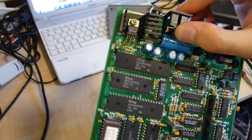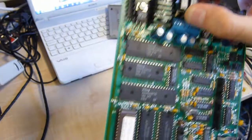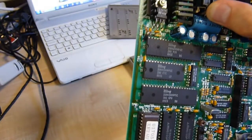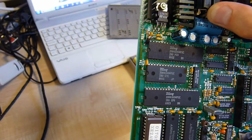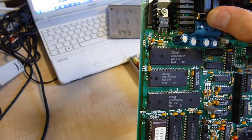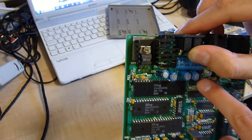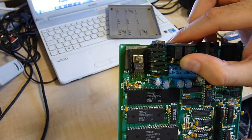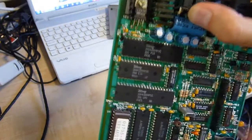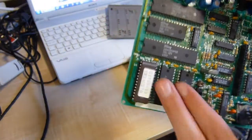Now, the main CPU will make all the Spectrum fans wet, because it's a Z80. And of course you've got your classic EEPROM right here with the operating system on, with two what look to be mask ROMs. Actually, I take that back, they are probably more likely to be RAM, because I don't see any other RAM chips on board, because this is 74 logic. That'd be for the modem probably, same with that. This is 74, and we've got some 4000 series logic here, and of course, the internal battery, which as you can see, I have replaced. So yeah, this is your RAM.